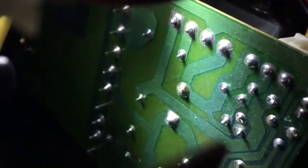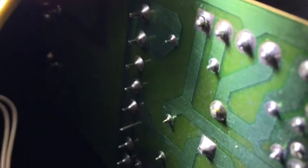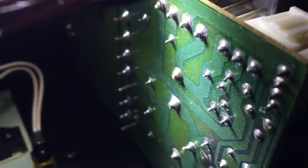I was using it and it just stopped working the other day, so I decided to take it apart and look at it. I've seen a couple of bad solder joints that I fixed, but one thing I'm thinking it probably is is this IC chip. You could see — look at all the four solder joints on it. You could see that they're all cracked. I can grab the chip and you can see the cracks open up there. That might be part of the problem — it's an IC chip. That guy right there, and I found all four solder joints are cracked on that.